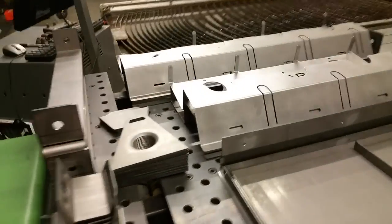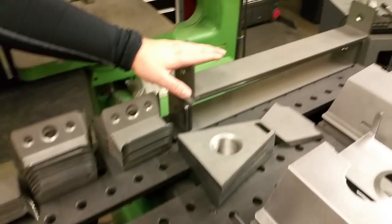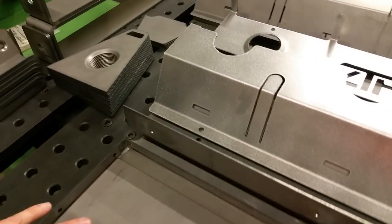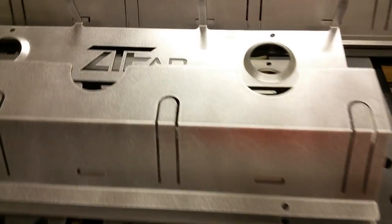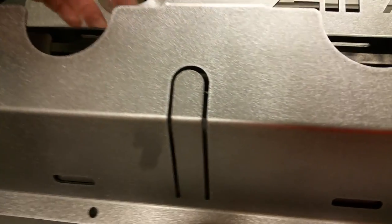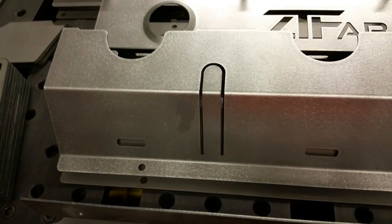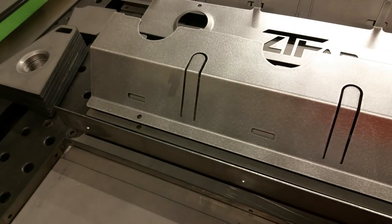Alright, here's some parts you made up. Yeah, so we've got a lot of the components that make up our cart kits. We've got our cord hangers, our quarter-inch axle brackets that sit below the welding cylinders and hold your 5/8-inch axle shafts, and the ends to our bottle brackets that hold your bottles up on top. We've got one of our drawer kits — this is how it ships in knock-down form. We've also got our three-place and four-place grinder racks — these are wall-mounted units, come ready to paint. They have integrated cord hangers as well as tool holders and pegs for consumables up on top. So these you just bend them out and hang your cord? I leave them unbent because a lot of people now have cordless grinders and don't need cord storage.